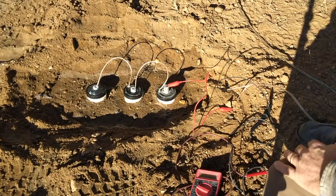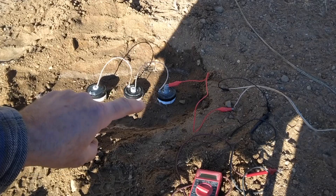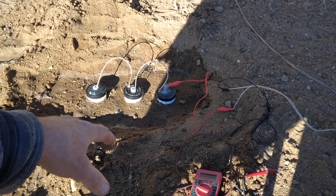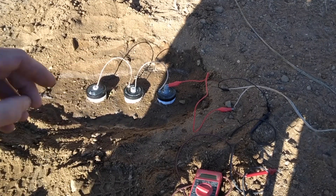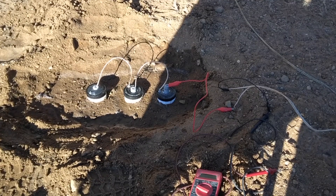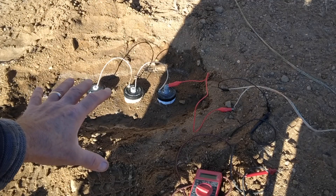So that was my solution to hooking up ground batteries in series — it's a little bit of cheating, but it works. The ground will keep these cells moist. I'm not going to dig these down yet — I've got a lot more experimenting to do, so these won't be getting in the ground this year since the ground will be frozen pretty shortly. I'm going to pull these out and take them back inside. If I want to hook them in series, I can just take a bucket, put a bunch of dirt in it, and keep them damp that way. That's how I'm building up the voltage in series. I'll make another video on how exactly I make these cells — so we'll see you in that video, and that'll be the end of this one.